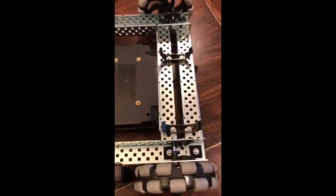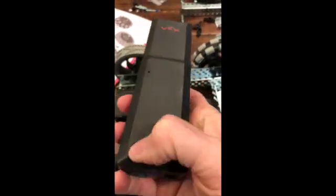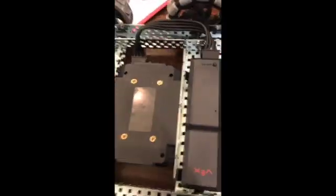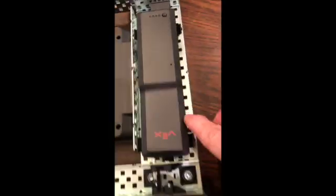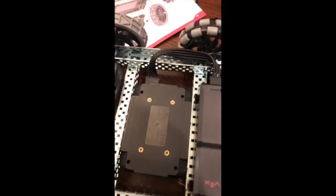We're just about done — flipping the robot over and starting to plug everything in. Before flipping, the battery goes in first. I've been charging the battery this whole time. Press the power button and I have four lights — four spots on it. The battery plugs in right there and then the other end into the battery. After plugging in, wrap and tuck the cord back in and snap it in place in the battery clips. I like it oriented so you can see how much battery power you have left at any time.